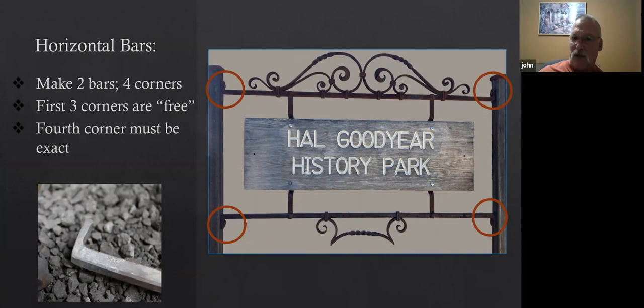For me, building this thing, the first step is always to build all the framework. So I start with the two big pieces, which are three-quarter inch square, and they have the four tabs that are folded up like square corners. Since our constraints are pretty loose, we came up with the number of 47 and a half for the overall length, and it doesn't have to fit into an existing framework.